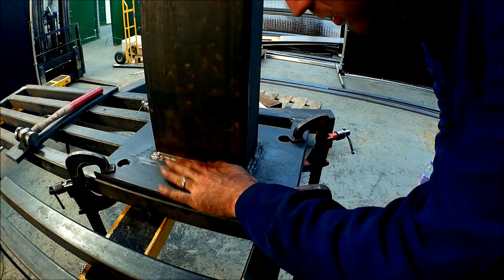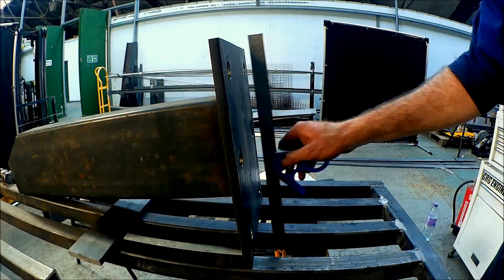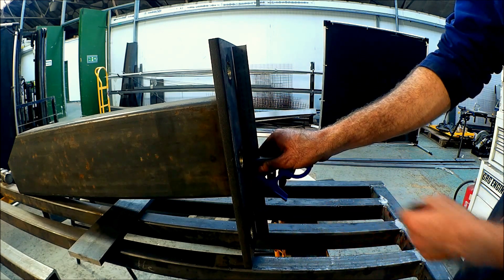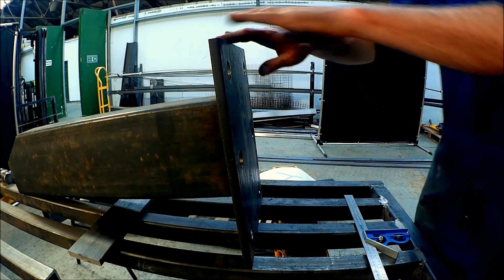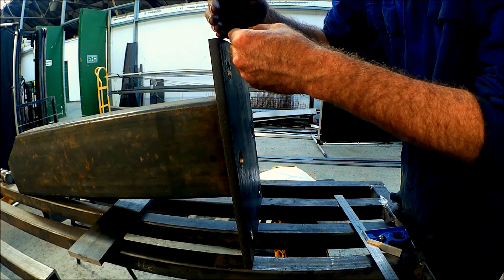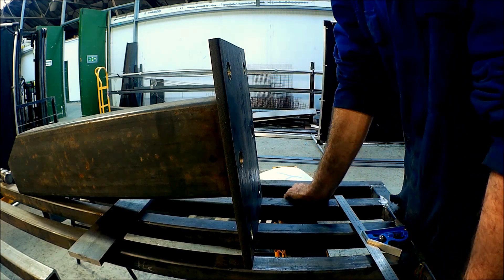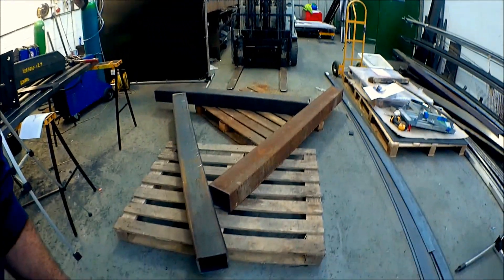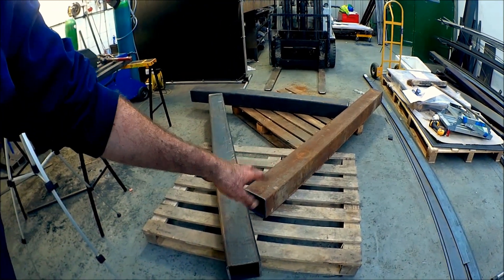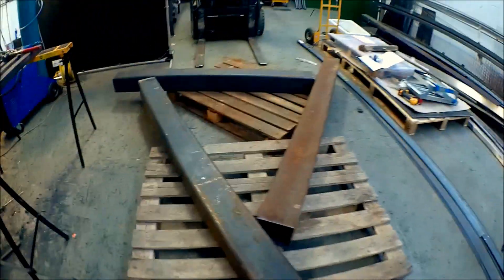So it's warm to the touch — let's see if it's distorted or not. Yeah, you can just about see light either end. That was to be expected really. When you're doing anything like this, especially fitting it on site, you do leave a tolerance anyway. I purposefully left a gap for shimming and grouting and all sorts, so it'll be absolutely fine. Whilst I was waiting for that to cool down, I've arranged these large bits of metal in this kind of shape to start preparing for creating the Y-piece — the actual main frame of the staircase.